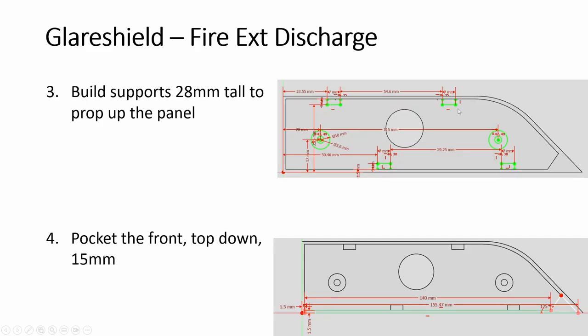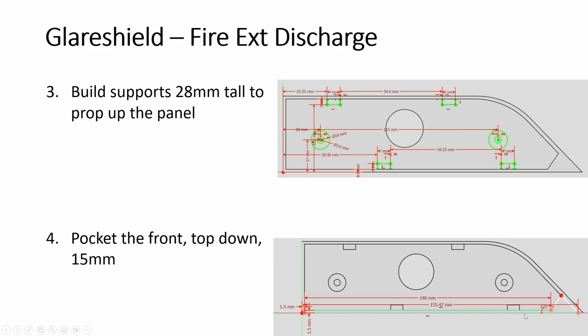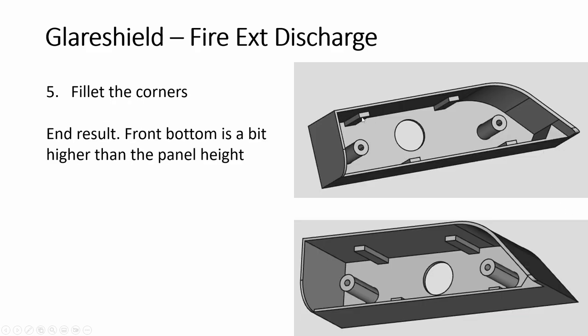So we build a shape and then we make a fence — you have a fence and you raise it up, and then it becomes like a box. Then you provide support here because later on you want to put a panel sitting here. This front part we pocket down because the front is actually slightly lower in height. Then these four supports, together, are all to put the panel sitting on top, and then hold it down with two screws. These pillars have to be thick enough, else I find that it breaks easily. Then the wires go through the back.